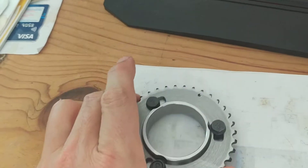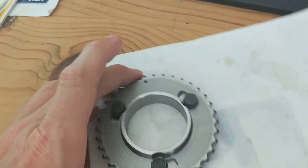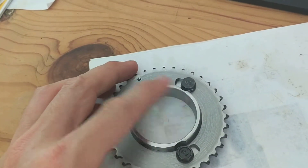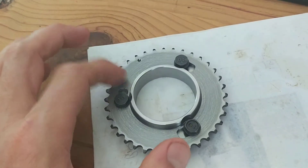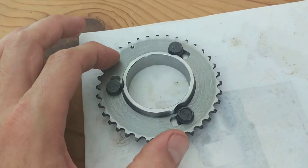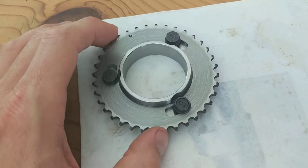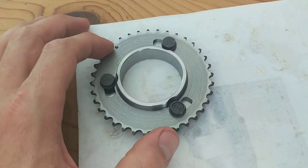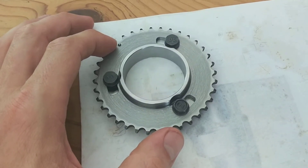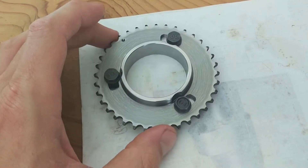This is version 2. With the first version I made a mistake — it was too loose, basically size for size, which I wasn't happy with. I didn't think I had any 256 cam sprockets, but I actually have two. I'd already gone ahead and machined a 256 34-tooth sprocket down, so this is our 447 sprocket which is what I need.